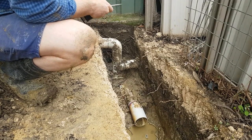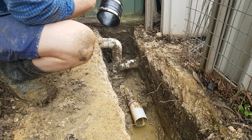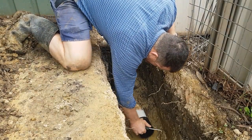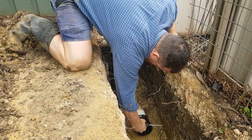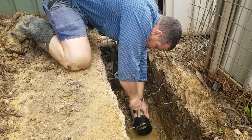Got all the water out of the trench, which is rad, and got it all falling nicely. So now I've got my Aussie connector here - I'm going to put that on, which is going to join up that 100mm to the next piece. Then we'll measure up a piece of pipe to fit where the tank goes and keep on keeping on.